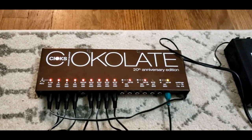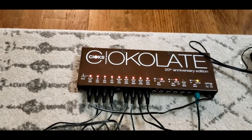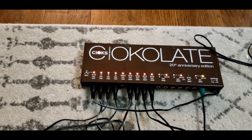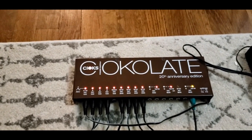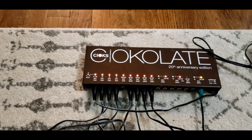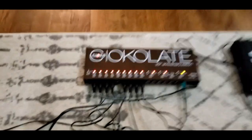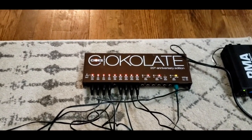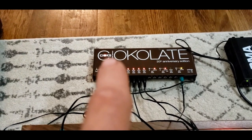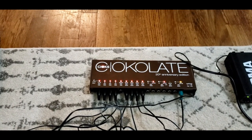There are variable AC outlets, and then they all have their own LED monitoring on each section so that you can see the status. What it'll do is the LED is nice and solid and bright right now. As you load it down, it'll get dim if you're overloading it, and if you've totally exceeded the capacity of that outlet, that LED will go out, so that you have a visual monitor of what's happening. Something else pretty cool that it does is you'll see this LED up in the middle of the O there, it's kind of hard to tell on camera, but what that's doing is slowly what they call breathing.